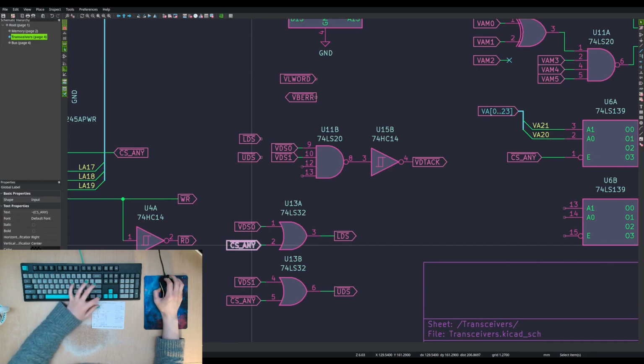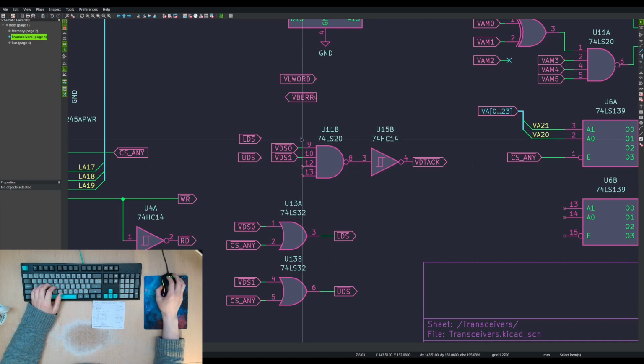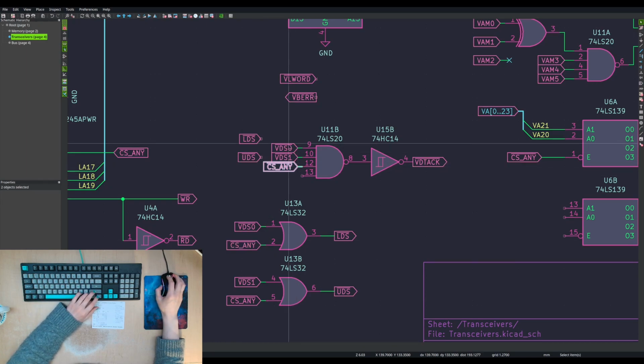Yeah, I was kind of like, well, okay, I've got a 4-input AND gate. I could have these two and have dummy inputs, or I could have those two, if that and that, but then that's actually not the condition we want, right? We want this or this and this.